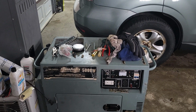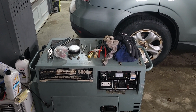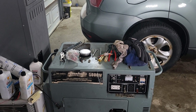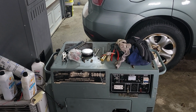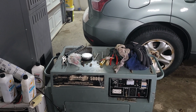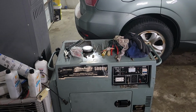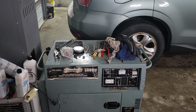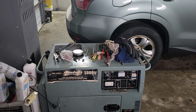It reached the cable in here perfectly fine, but it failed after about a minute and a half, 2 minutes of use. Also, it could not pull the throttle all the way. There was too much restriction, even though I could pull it by hand with no issues to assist the shut-off solenoid. But it did not have enough power to pull the cable to technically turn the engine on. It would go in the off position perfectly fine because this is de-energizing a magnet, so it would shut it off fine, but it had no power to actually turn it on. You actually had to assist it.